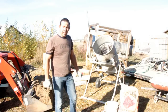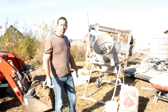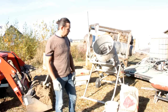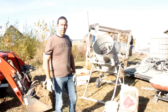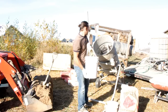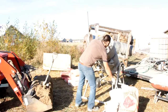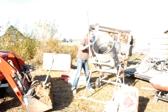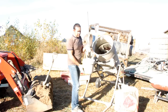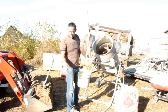Alright, so we're ready to get going on our mix. I've found a pail and measured out how many shovels of sand fit in there, and I use that for my recipe so that everything works out to be the 3-2-1 ratio. We're going to throw in about 4½ gallons of water, get our mixer going, and throw in our lime. Lime is caustic, and so is cement, so be careful that you don't get it back in your face, breathe it in, or get it in your eyes.